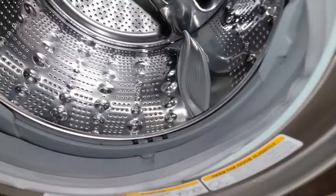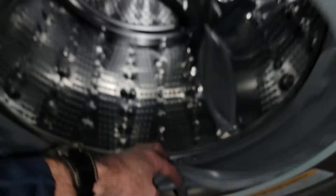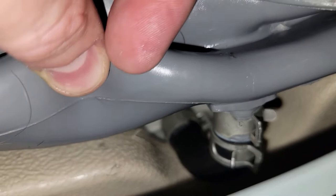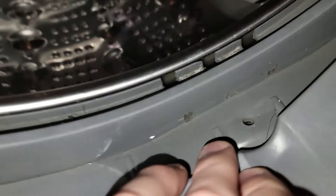My wife and I struggled to get that top ring re-secured, but the weasel definitely worked getting out all the junk. We were able to get the weasel to take the corner of the pipe by straightening it out a little bit. We think we have the ring clamps back on there secure, and now we're testing by putting a little water in — and it is going down. It is actually draining, so we are going to call that solved.